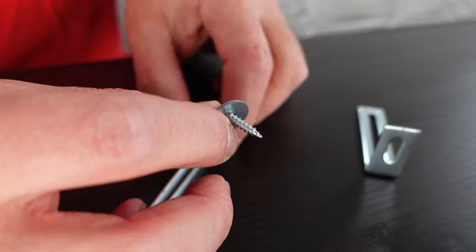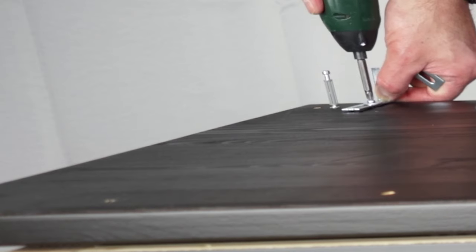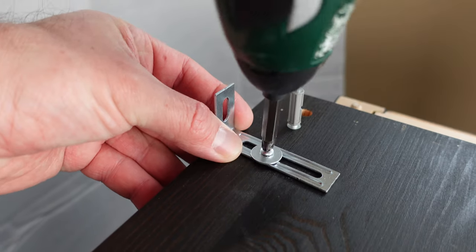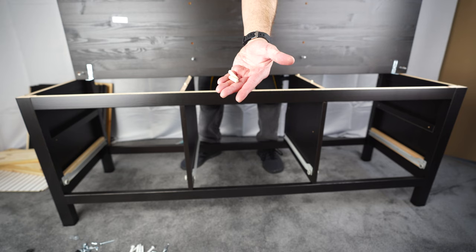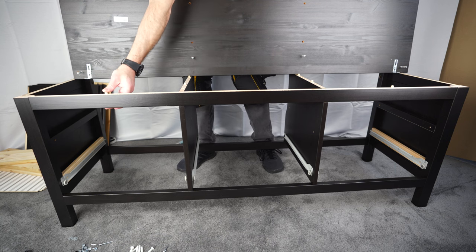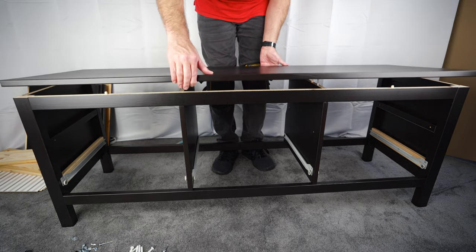Place the L-shaped brackets — these are there if you want to attach the unit to the wall. Secure them on the side with the screws, left and right. Small screw with washer goes through the L-bracket. Turn the top panel over so the L-shaped brackets will be at the back of the unit. On each side place two wooden plugs in the front slim panel. Now put the panel down and find all the holes together — six holes for the screws plus holes for the wooden plugs.